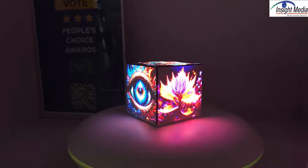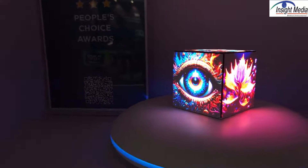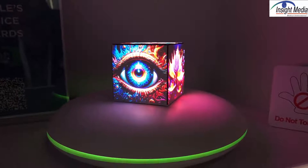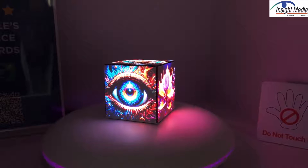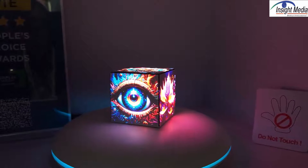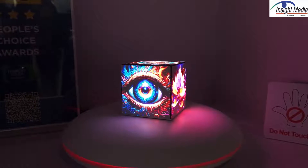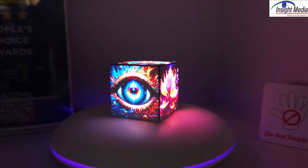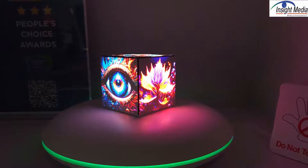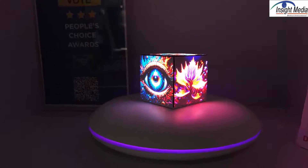This is very compatible with the way digital signage and video wall LED modules are put together today — that's the whole point of this. Because it's fairly bright — this one is actually 3,000 nits, but they can go up to 30,000 nits — because it's passive matrix, which means they can drive it harder. This also means you have to have a separate driver chip, just like in normal video wall applications.